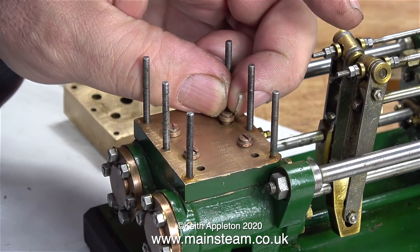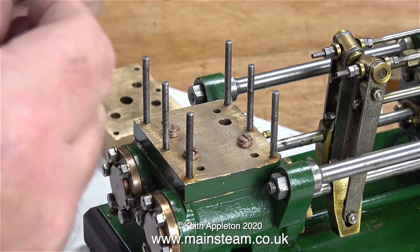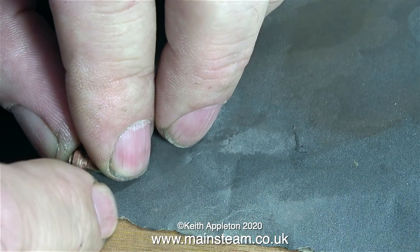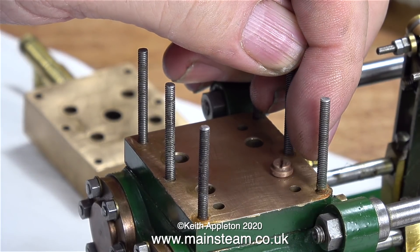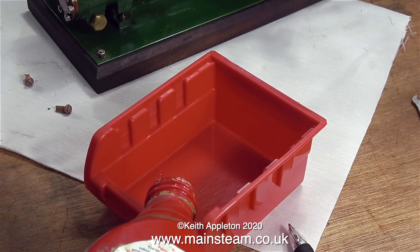You can see here that as I try to take the valve out of the hole, the shaped part that sits inside tends to stick. After cleaning it carefully on the belt sander, I finished it off on wet-and-dry sandpaper. I did this to all the valves and it took ages, but now I can pop the valves into the holes and pull them out very easily. All I need to do now is lap each valve to make sure it's watertight.